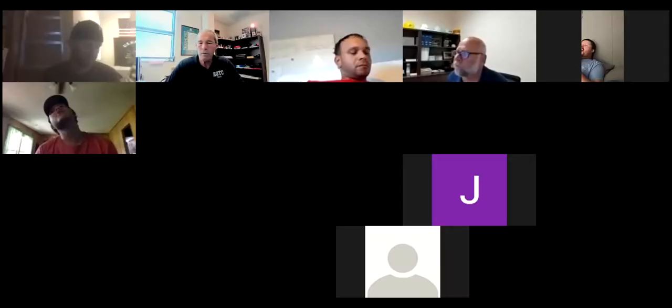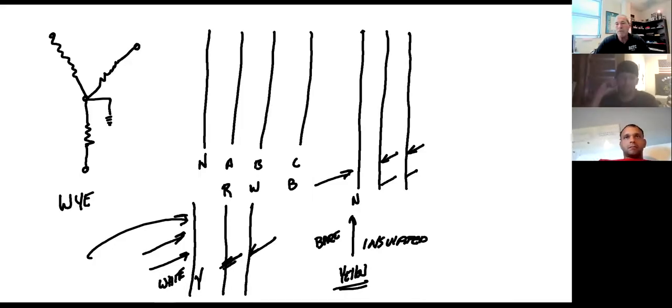Stop share. So when we're using three-phase, and we have three-phase going to an establishment, you guys know all the stuff that we talked about before. We've got voltage all the time, and what we're able to do with three-phase is now introduce what they call rotation. Three-phase is very, very good for powering motors, and that's mostly what it's used for. Of course, the utility industry is going to have three phases on a pole to evenly distribute power too. But a main benefit here is I'm going to have the capability to power a motor with three phases.